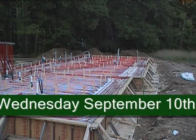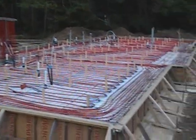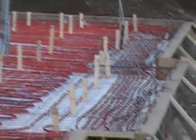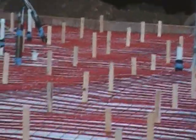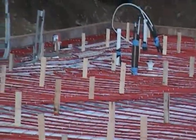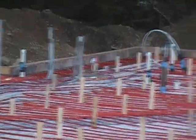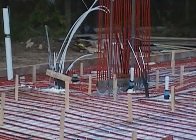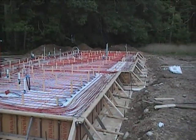About a quarter to seven on Wednesday, September 10th. All of the geofoam has been laid, all the vapor barrier's down. The radiant guys came in over the last day and a half and laid all that PEX tubing out — they actually bunched it up around the edges for extra tubing. The cement guys came in this afternoon, drove their stakes, and shot their grades. Concrete's on its way — it's going to be here tomorrow morning at 7:30. Electricians came in yesterday and ran some conduits. Plumbing is all set and sealed up. Everything's all prepped and waiting to go.